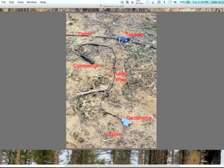How are we going to record the seismic signals that we put into the ground with the vibrators or sledgehammers? Well, we have our sensors called geophones. Here's a geophone, which we've talked about before. It's a vertical ground velocity sensor. The magnet that will move against the inertial coil is connected to the ground with this spike. This one is a very simple system where the lead wire comes out and just delivers the millivolt impulses, the millivolt waves we get out electrically, through this connector to this takeout, which is really just a connection point along a longer cable.